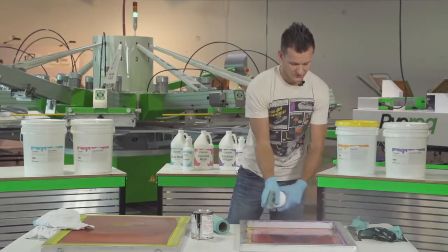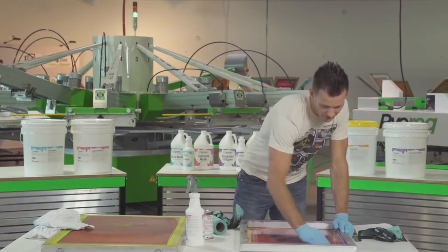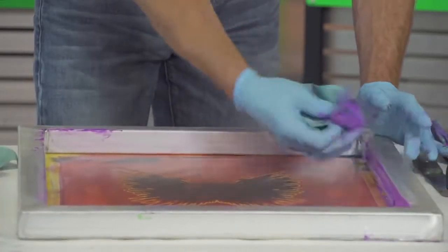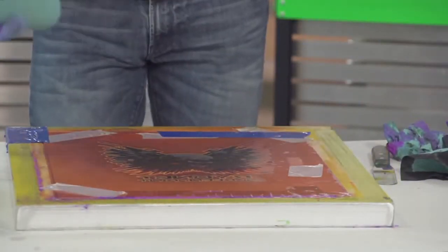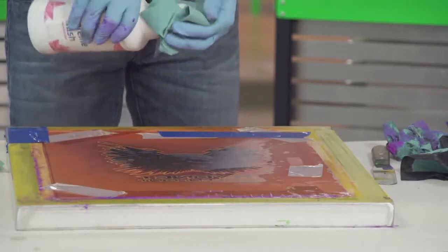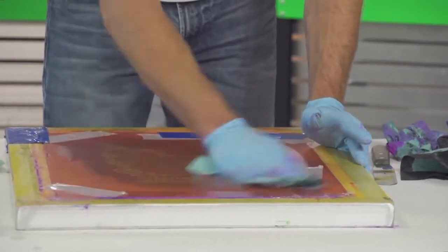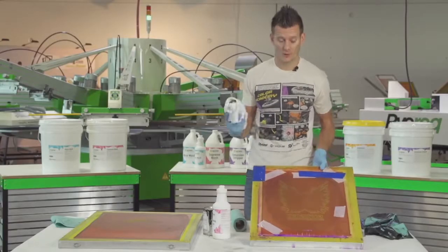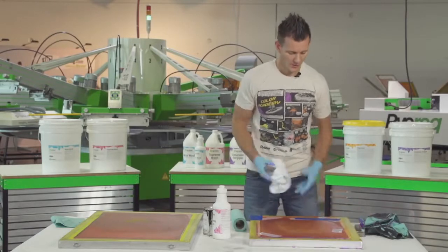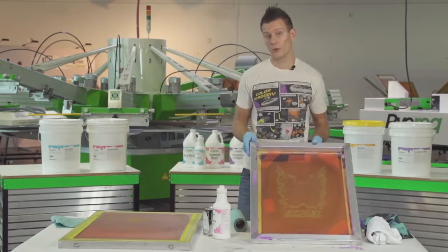Here we are on a plastisol screen, getting that nice and worked up there. Start with a dry or slightly dirty rag so you can see how well that's cleaning this plastisol. And this is a pretty gunked up screen. Okay, flip the screen over for the back side. Get a little bit on our rag like that. Just wipes on off. Residue test with a white rag. There we are. Stuff evaporates very quickly and cleans very, very well, leaving a very minimal residue or oil behind.